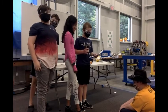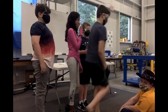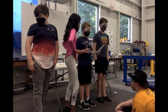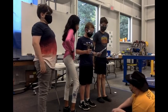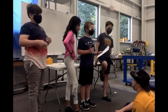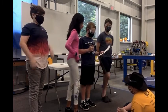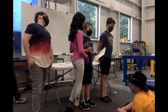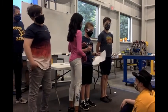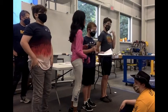And in some parts it's 2 inches tall. Our goal is for a robot to be able to clear it, and we want a robot ideally that can go over 2 inches tall, but at least to be able to go over 1.5 inches. The problem that we have right now is that the wheels that we have have a radius between 1 7/8 and 2 inches, and that doesn't work out very well because we also have to have a shaft somewhere that's spinning the wheel, and so then we probably won't be able to clear 2 inch triangles.